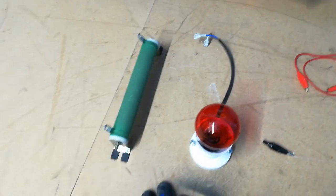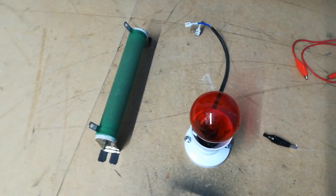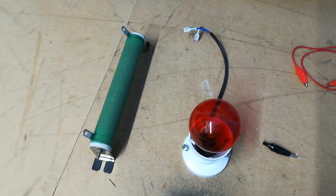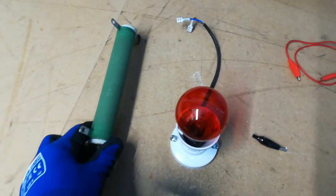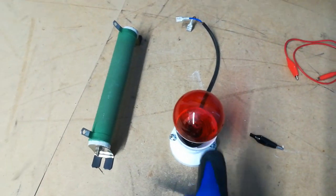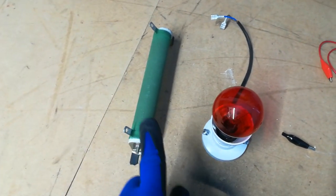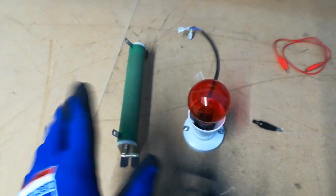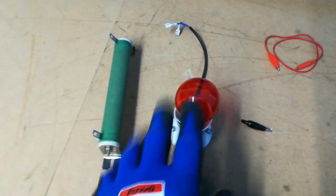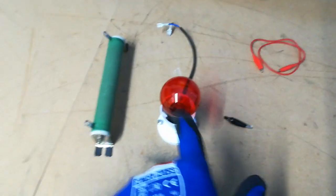Connect the bulb to the battery in exactly the same way as the charger — turn the main switch on and the bulb lights up, burning off power from the battery. Leave it connected until the bulb goes out. This is a 60-watt UK 240-volt bulb; use the equivalent 60-watt incandescent bulb for your country. Alternatively, use a 300-ohm resistor — it's slightly more subtle, but has no visual indication. With the resistor, as battery voltage falls the current decreases, whereas the bulb maintains more consistent current. The choice is yours, but I prefer the bulb — it's simple and you can see if high voltage is present.